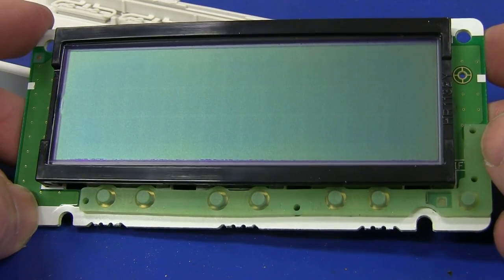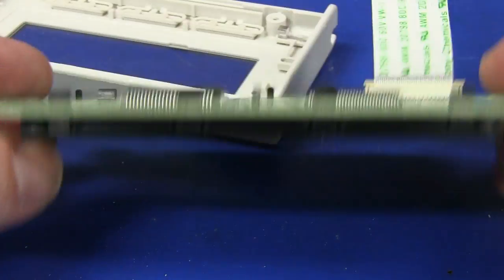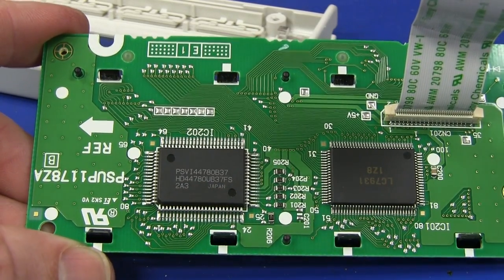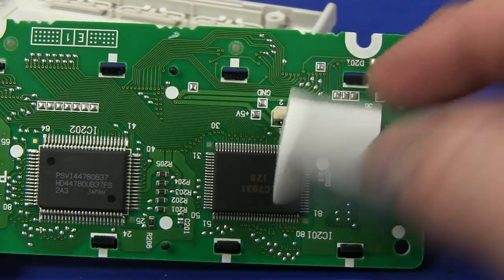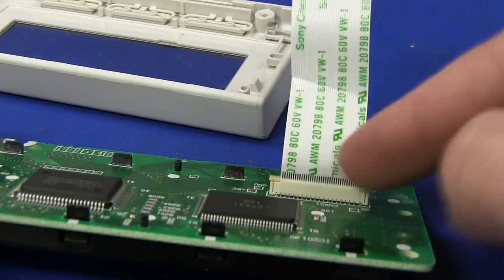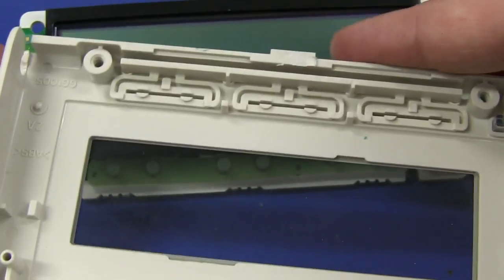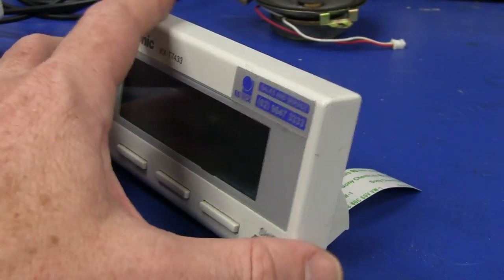And here's the LCD module — it's a rather curious 16 character by 3 line display. And yes, it is standard Hitachi 44780 standard. But unfortunately the connector is a weird fine-pitch 36-pin job, so not standard pin out there, but you could certainly hack into that and drive that display. It's got little buttons here as well — presumably why they've used a larger flat flex there for the larger pin count. I would keep this entire thing because it has the buttons and everything else. Check it out — it's even free-standing. What a Bobby Dazzler!